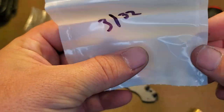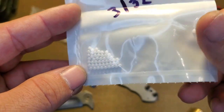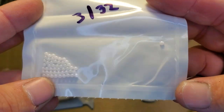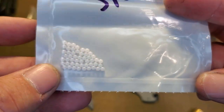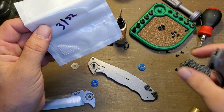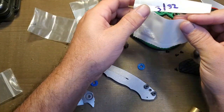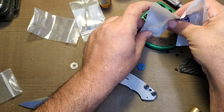The ball size you want is 3/32 inches. I've got some zirconium oxide ceramic bearings — these are slightly different from silicon nitride, the black ceramic bearings. Zirconium oxide has a slightly softer hardness, which makes them probably better in titanium frame locks where there isn't a hardened steel washer. They also look really cool. I got this batch, and I'm dumping them onto my mini work tray from Journey Tool Company, which has been surprisingly handy for keeping bits organized.